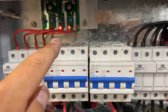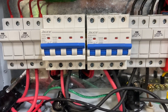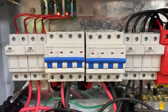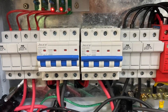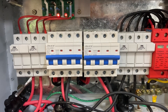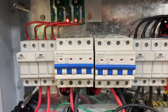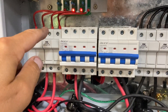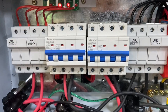On another note — you'll see both these lights here mean my PV is on. I try to throw this in every video involving PV or electricity: while you're working on this, if you're doing any work on your PV lines or anything electrical, do not have it on. Disconnect them before you work on them. I know that seems redundant, but I feel the need because you're dealing with high voltage — this string here has 350 volts on it right now. That would kill you.